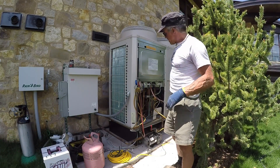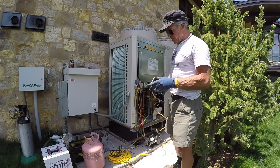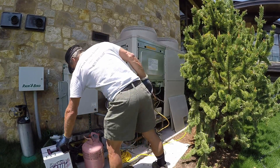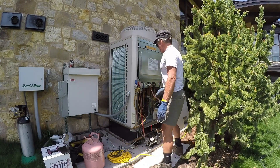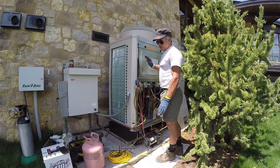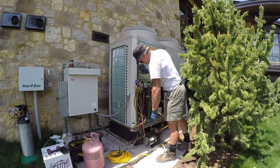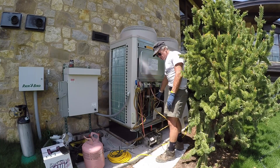We're finally making some progress here. I got sidetracked doing a bunch of other stuff. So we did our nitrogen purge — you saw that. We finished up the main electrical feed too. We just did our last nitrogen purge and it held well.